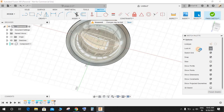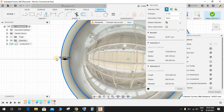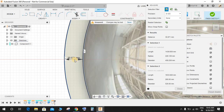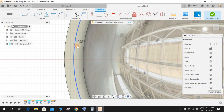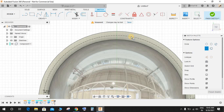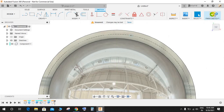Let's measure the distance — the distance from here to here is 30.871 mm. I'm going to construct a center circle, so 30.871 divided by 2. I'll offset this up to a distance of 30.871 divided by 2 and press OK — it will automatically make a circle on the center. Set it to construction mode. Now press C for Circle and at any point make a circle of diameter 10 mm. Finish the sketch.